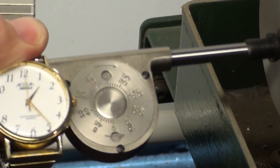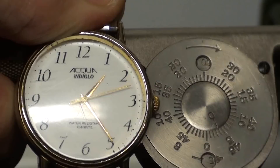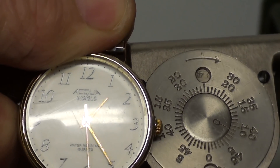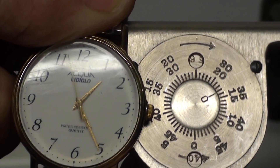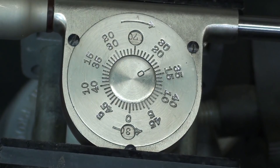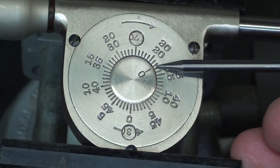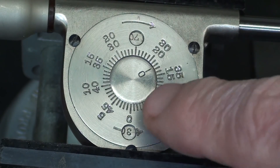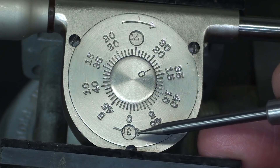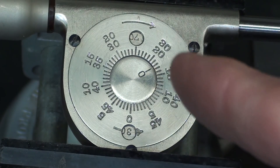And here we go. Looking at the dial now, you can see that I have measured seventeen hundred RPM, plus what's in the window — it reads thirty. So it's seventeen-thirty, but there can be a little bit of error depending on whether I engage and disengage it at exactly the second mark. But at any rate, thanks to Mr. Tesla and General Electric, I know that the actual speed of the motor was seventeen-fifty. So you can see this is right on.